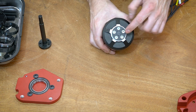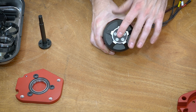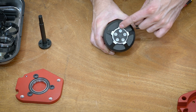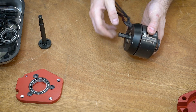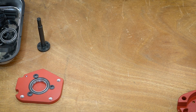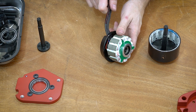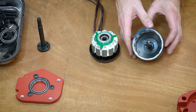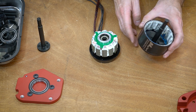It mounts to the back of the motor right there. This is actually a two-piece — we have two versions of this, and this is just for the backup. It mounts directly into the can of the motor. The motor has actually been machined down so that it can have this bearing support at the end of it, and then we have a hex on the other side. In addition to the new shaft, this motor is also fully battle-hardened. You can see these sensors here — we have epoxy all around the sensors, all along the stator, and also inside the motor can on all the magnets, so that when it goes smash-smash, these things don't explode all over the place.